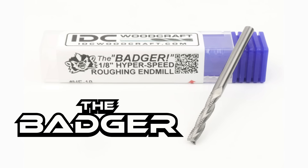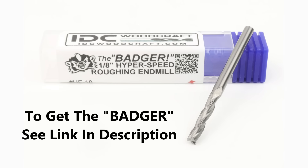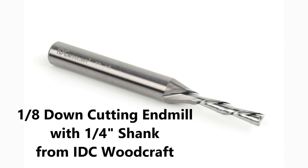If you don't have the Badger, you definitely want it in your arsenal, especially when cutting out a lot of material — I'll link it below. I've offset the project lines just a little bit because the Badger will leave a rough cut. Now I'm going to show you the finish pass with the one-eighth down cutter, running at 20,000 RPMs at 100 inches per minute, which just cleans it up really quickly. With that thickness it won't do much work, meaning the cutting blades will last a lot longer.